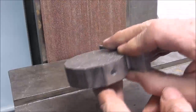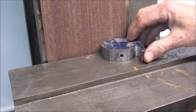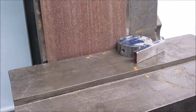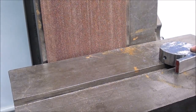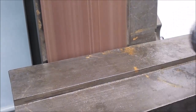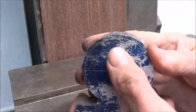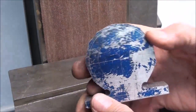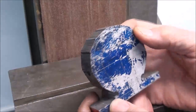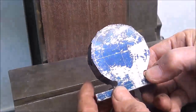It's been rough sawn now. For those of you at home, if anyone ever makes this you can use the belt sander, but the problem is you can't get in here with the belt sander — you might be able to with a little one-inch wide that has a narrow platen. I'm going to approach it a different way. Notice I've lost most of my layout lines — I think I'll re-touch that up, put a little bluing on it. I still have my center hole, but I'd like to be able to see these circles, so I'll do that off camera.